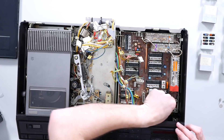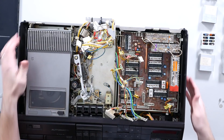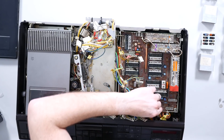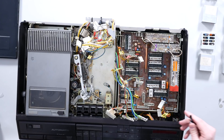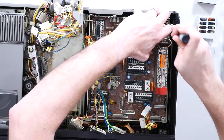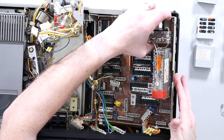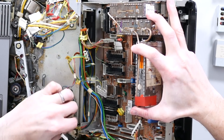I've not actually found the power management here yet. As the power comes in down there somewhere, presumably at some point we're going to find a whacking great transformer, and that would explain a good chunk of the weight. I can't picture this having an inbuilt switch mode power supply — I think that'd be far too noisy for the video signals. I want to bend this far enough to get it out, but if I bend it too far and break it, it's pretty much irreplaceable at this point.